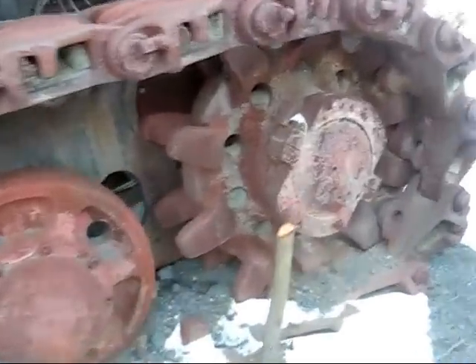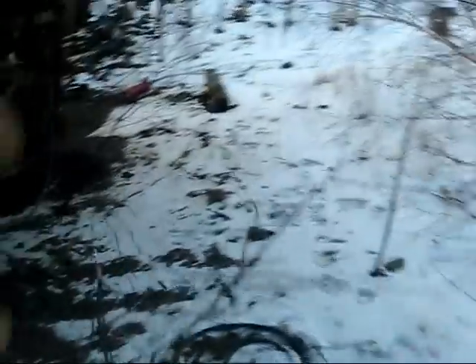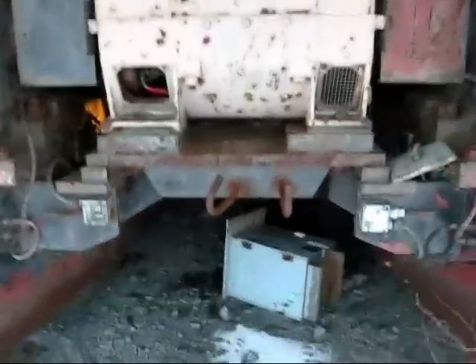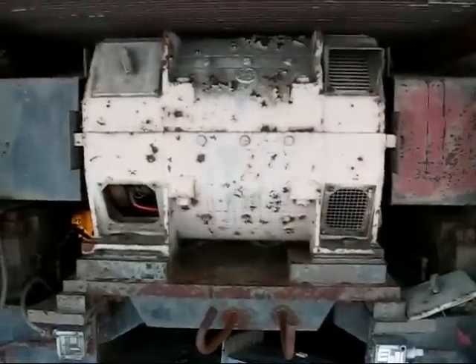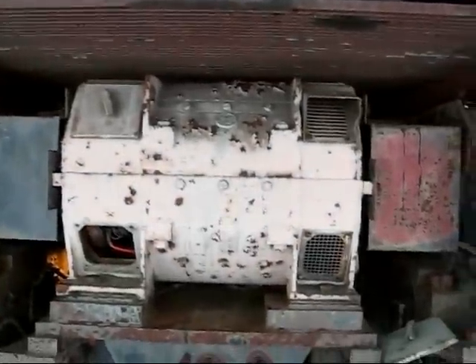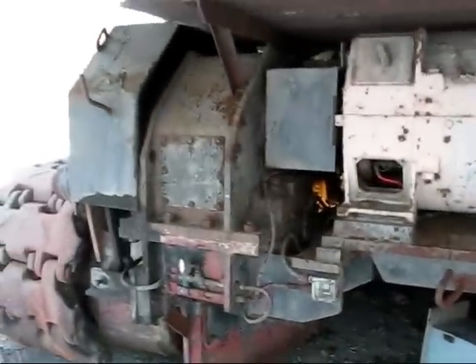Here you can see all the individual rollers, and on the back you can see the drive sprocket to propel the machine. On the back of the 195, this is where the trailing cable would run out of the rear of the machine to supply the shovel with raw power. This is also where the two electric propel motors are located to drive the lower works, which was one improvement made when this machine was upgraded to the Series 2 version in 1978.